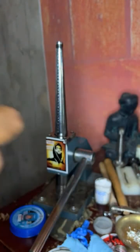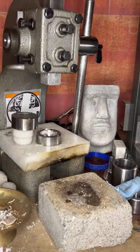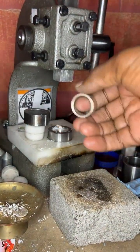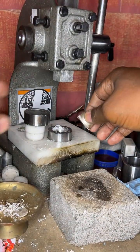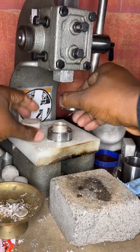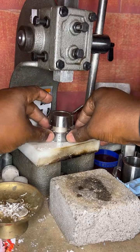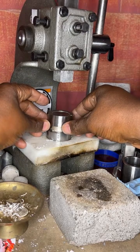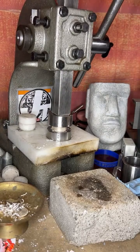Okay. So let's go back to the 1-ton press. And all we need is a little push down, and the ring should be the right size without damaging. Okay, so we have here the 25-degree die, and all we need is one little push. Okay, guys, I'm hoping I don't push too far, because then I would have to start all over. The ring has to be 11 3/4, not a 12.